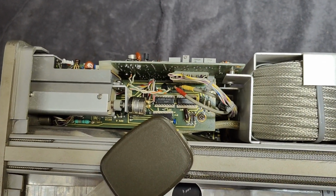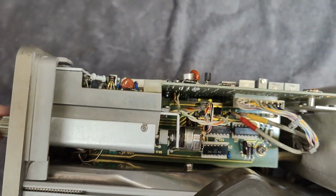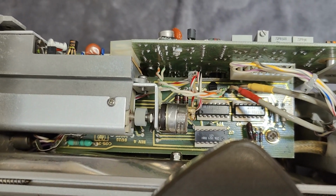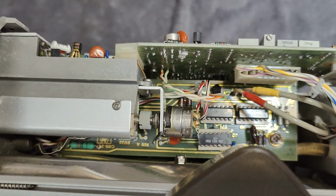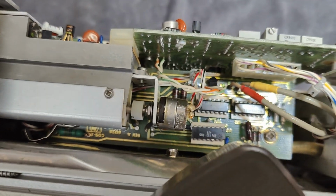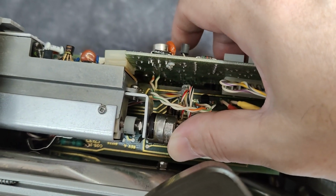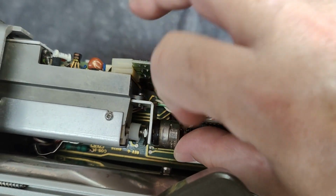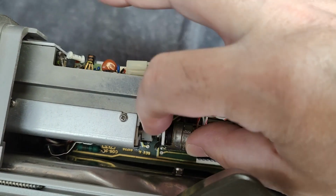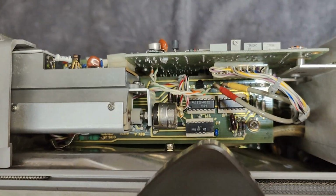When I went through the instrument before I even opened it, I noticed the channel A variable here was really loose. Look at that, the whole potentiometer here is completely loose. And I think it's just this nut that is causing all this problem. I did expect to find a little hole in this piece of aluminium that will kind of stick to this or lock to this, but that seems not to be the case. Just tighten the nut that will solve that.